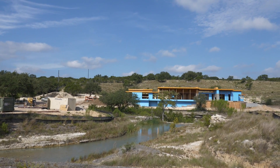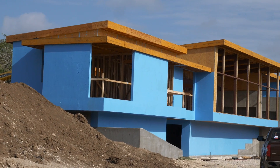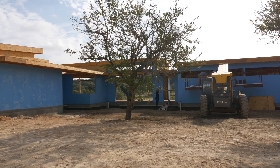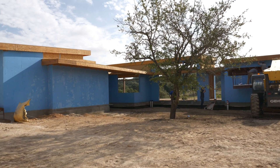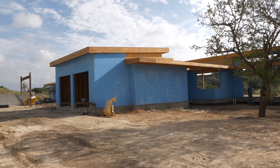You and I both have done a lot of houses before with traditional house wraps and peel-and-sticks. How does this fluid applied compare to those? I've used several fluid applied products in the past, but this system has got a much longer exposure life than the other products I've used, which is one of the reasons we went to it. Doing the size houses we do, there's times where these houses could sit five, six months before we started getting siding on it. And so that's always the concern — the degradation of the product that's been applied.